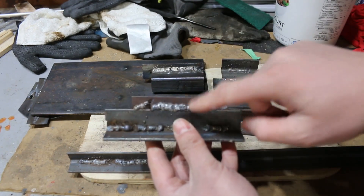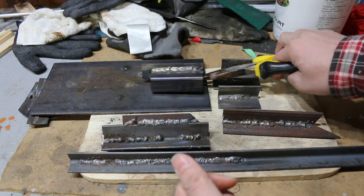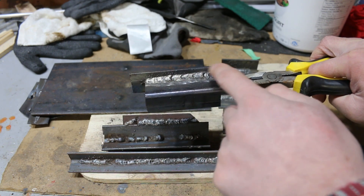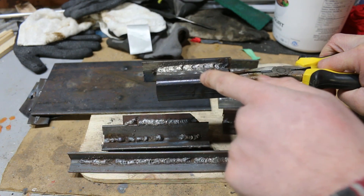However, I wasn't happy with that, probably because the base metal was dirty — I was a little lazy and should have cleaned it. Once I cleaned the base metal, this guy here is really, really great. Nice and even, it's shiny, it looks good. That's the other thing I really like about MIG: there's no slag to chip off, which is awesome. You just wire brush it and it looks nice, bright and shiny.